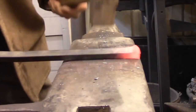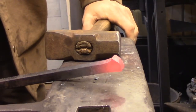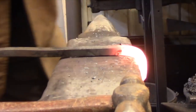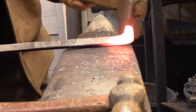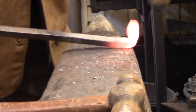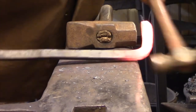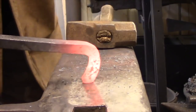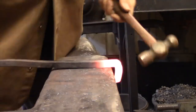It may not look like I did a whole lot, but when I push the metal all over to one side you can see I've actually gained a fair amount. The other application for upsetting is to provide extra material somewhere along the length of the bar. Here I'm demonstrating what's normally referred to as a square corner — when you bend a bar without modifying the shape, the inside and outside of that bend are curved. When forging a square corner, you tighten up that curve so you can hammer the ends of each bar going into that corner, then upset those two bars to get the extra material needed to fill in that radius and provide a nice outside square.